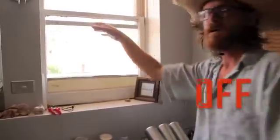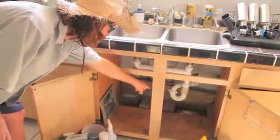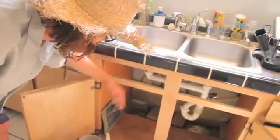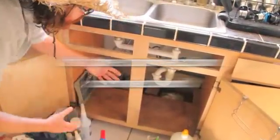That's on, that's off. You can see how the air rises through the kitchen window. The air in the house is warm up here and the coldest air sinks to the bottom of the floor. Coldest air in the house is drawn in. I've got two vents under here — I just took a sawzall and cut some holes, then took accordion vents from the hardware store and bent them to go through the wall into the Trombe wall. There are also small holes drilled under here, so all the cold air is pulled in as the air rises, drawing cold air down and in.